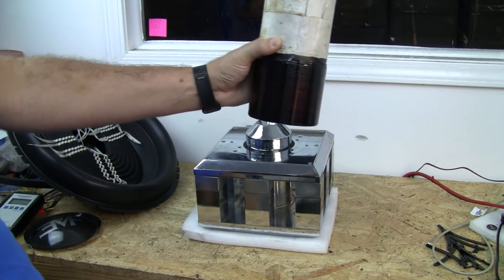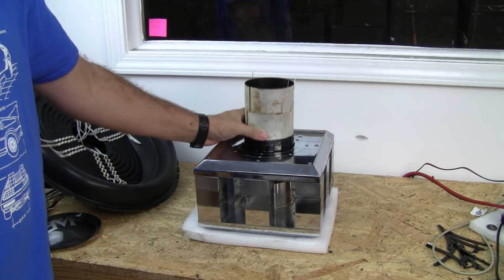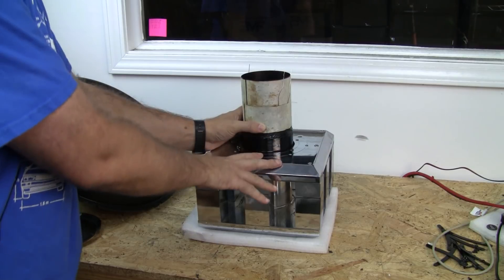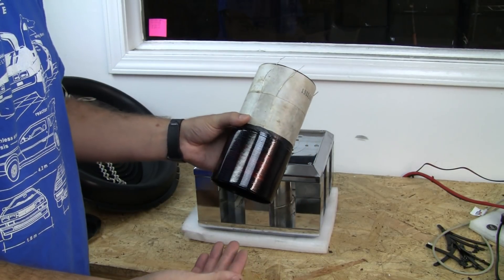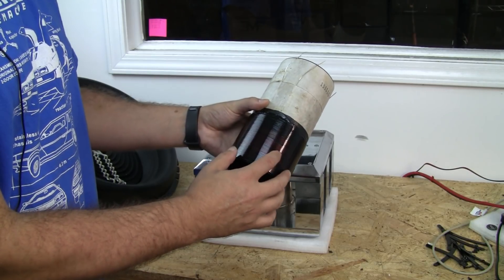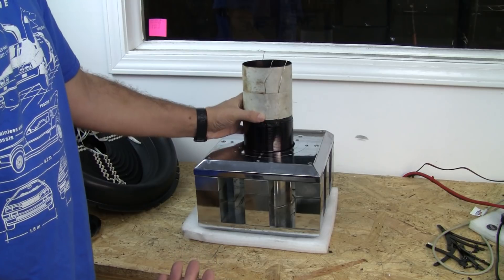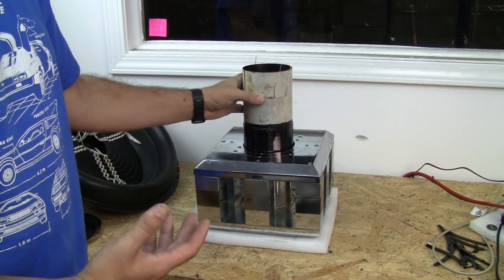For a better look at what's happening with the coil — the coil sits in the gap and is moving up and down the entire time. What's happening is you have an electrical current going through the coil, and that coil is responding to the magnetic field of the motor. If this was not magnetized and you just applied power to the coil, it's not going to go anywhere — it's just going to generate heat, basically like a convection heater. When you take this coil and put it inside a magnetic field, that's what makes it move. The frequency you're playing is the frequency of AC electricity — that's how many cycles per second it moves. At 50 hertz, that's 50 cycles per second, meaning the coil will move down and back up 50 times in one second.